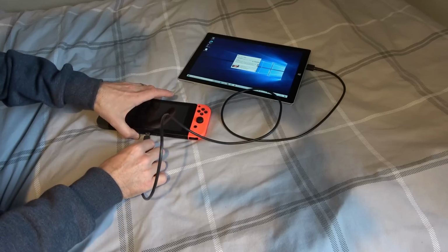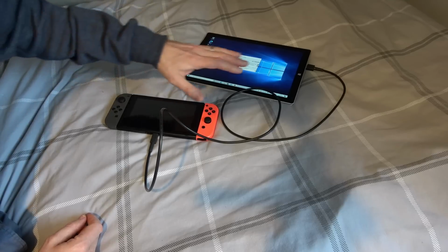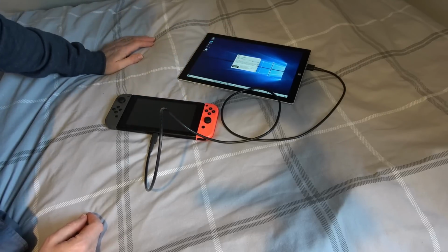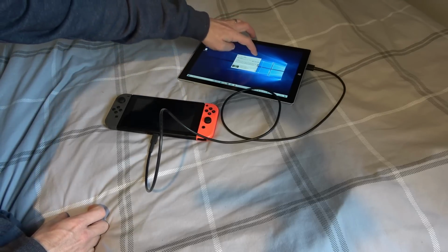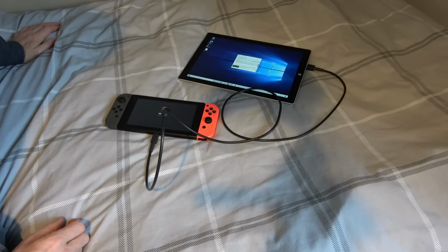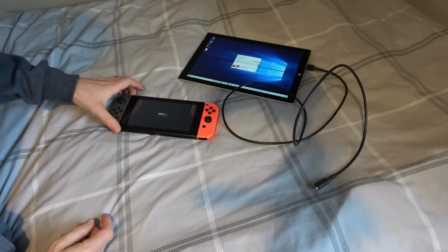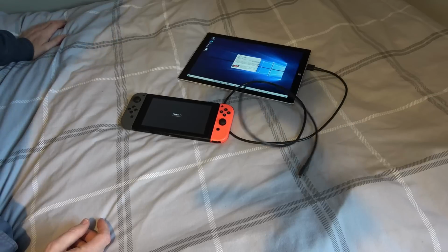So, first of all, you need to plug it in there. You need to inject something into it, so you're going to have a different device to inject something into it. Now it's come up with RCM OK there. I'm going to inject the payload like you've seen before. And now we don't need this anymore, so we can unplug this. Again, it comes up with 40 eMMC.